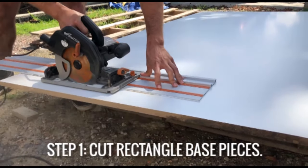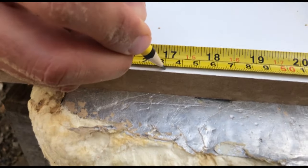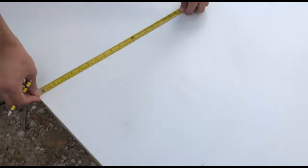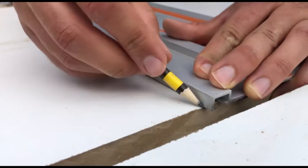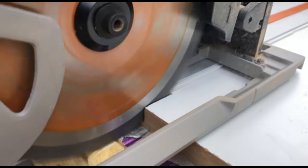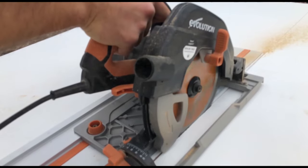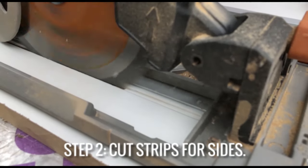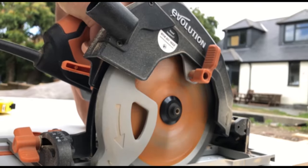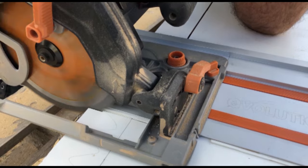First of all we're cutting all of the melamine board which is going to make up the base and the side pieces of the concrete worktop moulds. We're cutting the rectangular sections and then the side pieces and sticking them on. For the kitchen worktop we're making a front side piece that is very slightly longer than the other side pieces so that we can make it look a bit thicker at the front — it'll have a lip that drops down below the worktop.